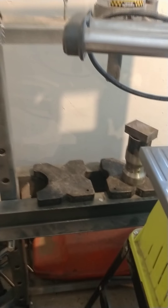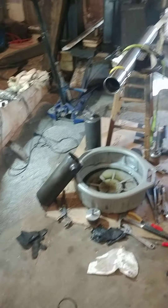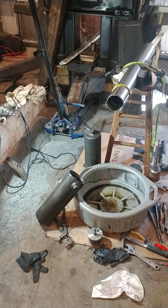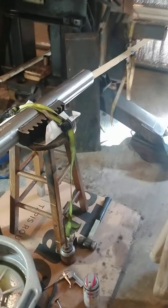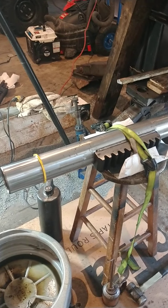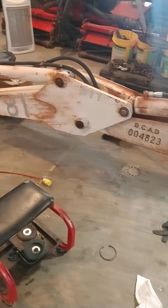I pressed it out on the press and it came out easily. The only problem was at the last stroke I heard a snap — that's when it cracked. I don't think it's going to hurt anything. It's a major, major job. I couldn't find any videos on it, but this is for the Bobcat 911 swing cylinder — it may fit a couple of other models too. I do a video once every couple of years, and this will be the one for this time. Good day.